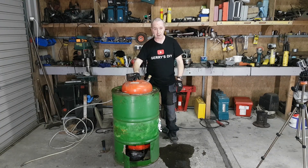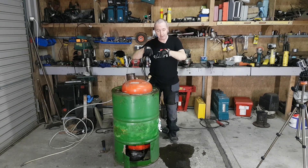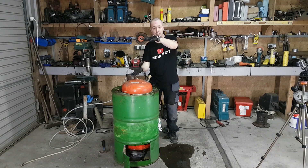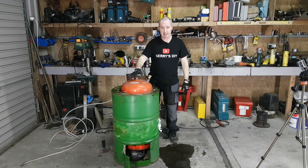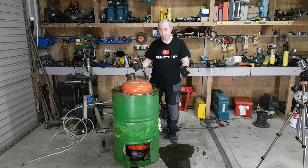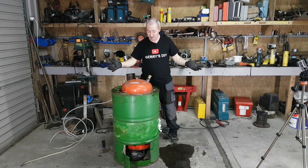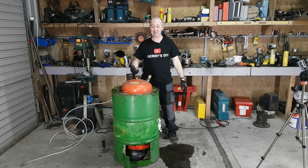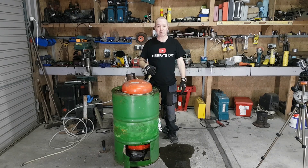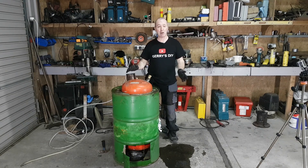There's a pipe to go to the bottom of this propane bottle - I'm going to fill it with water, drive the water in and take the water out the top. The pipe that goes to the bottom is going to be the feed, so that when I drive cold water in, I don't just mix it up here - the cold water actually pushes the hot water out. I'll put a couple of thermostats on it so we can see contents temperature and all that. I'm in my shed now with lots of heat because of one I made before, the same as the burner I just showed you. We're going to make lots of hot water in the next video.